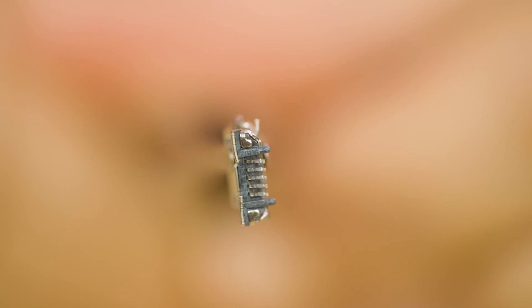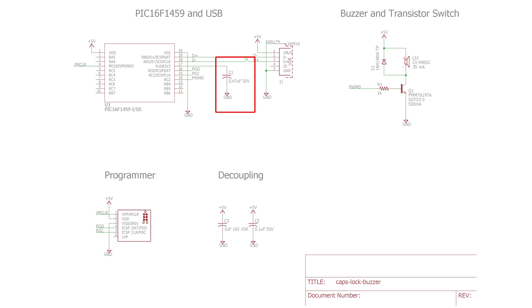You also have a 0.47 microfarad capacitor hooked up to the PIC. USB is a 5 volt bus, but this PIC microcontroller runs off 3.3 volts internally. It has an internal charge pump that takes the 5 volts down to 3.3 volts, but that charge pump requires an external capacitor to operate. The selection of this capacitor is very critical — you need something stable over temperature ranges. I went with an X7R; it took about two, three hours to pick out. You need to consider temperature range, capacitance variation, and low equivalent series resistance (ESR).